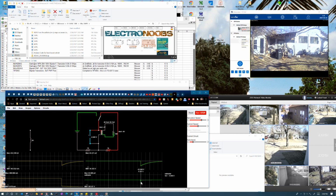This is generating a high voltage, like you might expect. You kind of expect 100 to 1 almost, which is interesting, because if this were just an inductor, that's what you'd get, because there's a 100 to 1 ratio here. I mean, you should see about 500 volts, and I guess you kind of are. This is headed towards that. It's 383 volts, so it probably would be 500 volts without a load. But then it very quickly drops to 50 volts, but that happens to be the same voltage basically we're dealing with here.